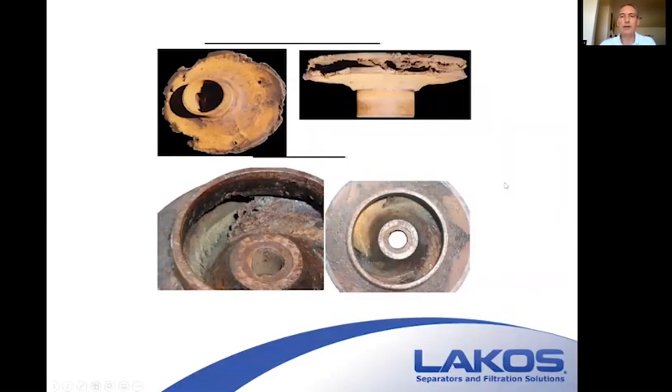When a pump is not meeting its NPSH — net positive suction head requirement — you end up with cavitation on the pump impeller. This is what we really want to avoid in basin cleaning; it's rare in side stream applications, but in basin cleaning I see it fairly often. A cavitated impeller looks like a shotgun completely blasted the surfaces and created holes in it. This is what we're trying to avoid with larger pipe sizes and making sure the cooling tower connection size is large enough so the system gets adequate water flow without starving those pumps.